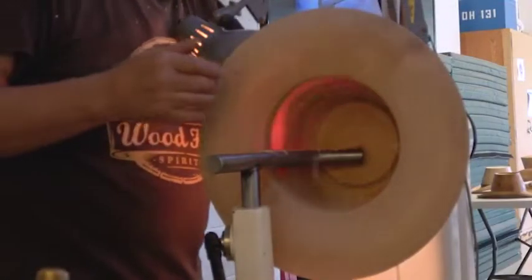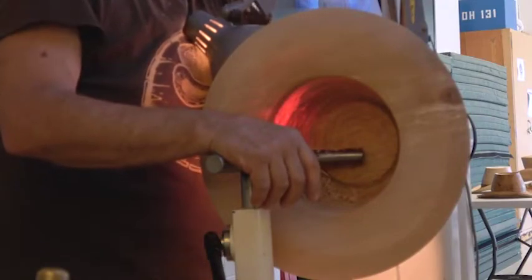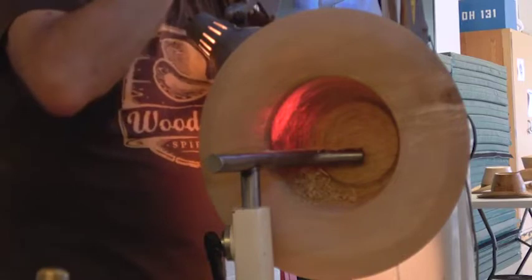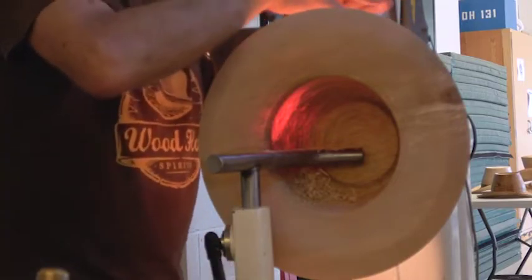And now I have to swing the tool sideways to follow the shape to get some light on the outside. Wet spot is still a little bit too low. I got to get further up in there. And I always wanted to get as tight as I could inside, so I used this narrow. I ground a 3/8 tool to a very narrow tip.